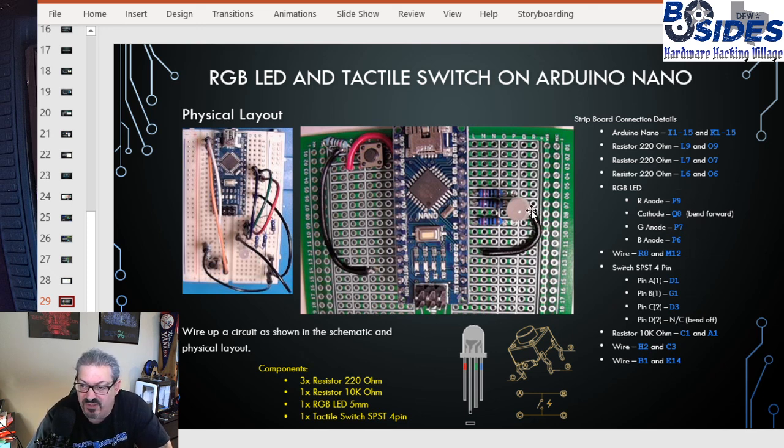One thing to note is when we go to connect up the LED, the cathode pin, we're going to need to bend that a little bit forward to get it to connect into a different place on the board. And as far as the button, one of the pins we're going to bend completely off that button because we're not going to use it and we don't want it to short out against one of the connections that's underneath it. So with that said, we will go ahead and start soldering this up.